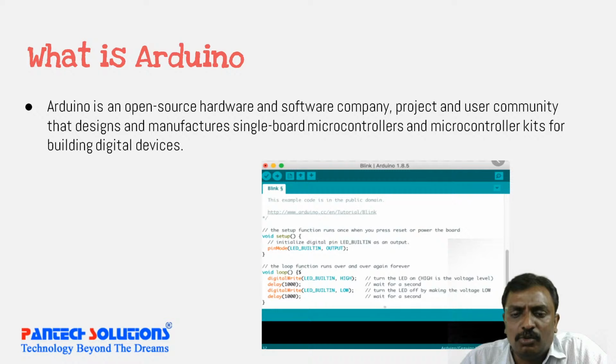So one advantage of Arduino is the software. They have their own IDE, where you need not worry about the details of the microcontrollers, about the registers. You have a lot of inbuilt libraries, and everything can be implemented in a single line of command. For example, if you want to send serial data, you could type a single line of code called Serial, and if you want to blink an LED, you could directly choose a pin and give the data, whether it is 1 or 0.